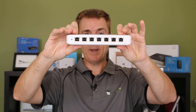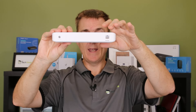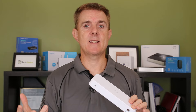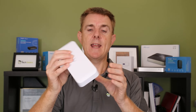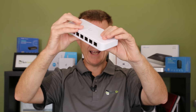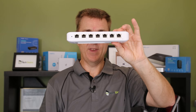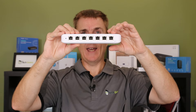So to recap: seven 1-gigabit PoE+ ports on the front. The back port is normal ethernet or PoE-in — it really wants PoE++ to work properly. You can send PoE+ but that only gives you about 16 usable watts, which might be okay for a couple of cameras. Couple it with the 60 watt power pack and you get 52 usable watts across the seven front ports. Add instead the 210 watt power pack and you get around 200 usable watts spread across those seven ports.